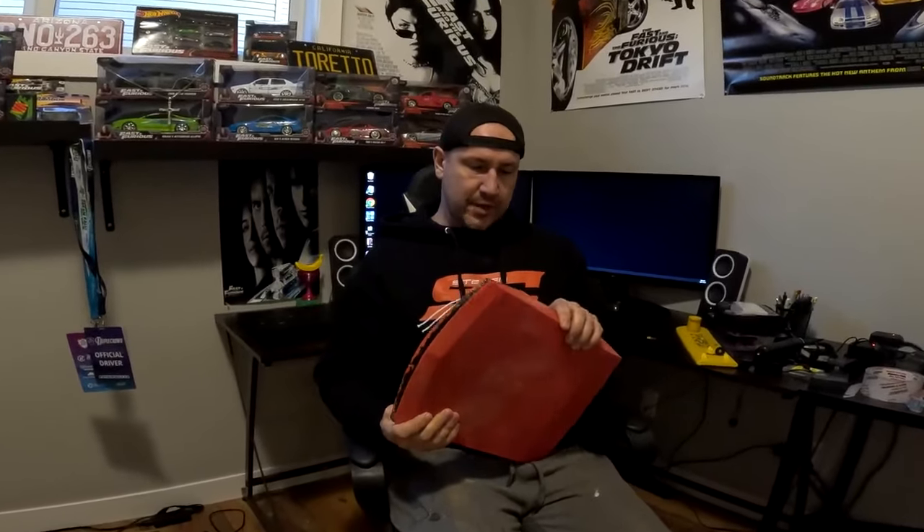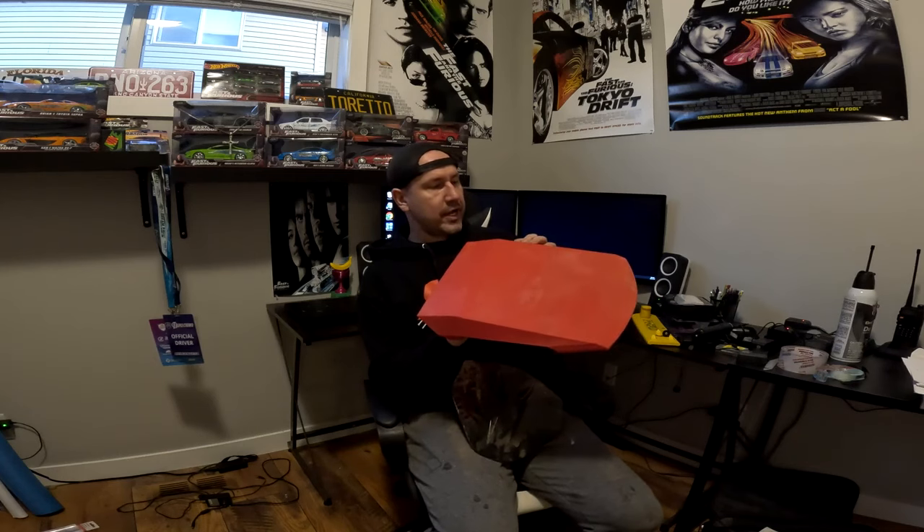We're going to the garage to make this one piece. We're going to start sanding it — it's pretty rough. I think I'm going to hit it with a 40 grit and then maybe an 80. I'm going to end up filling this gap here and then hitting it with a high build automotive primer. I'll let that cure and then wet sand it down to about 800.